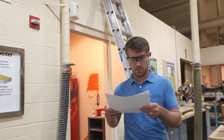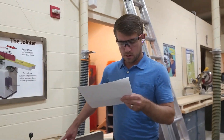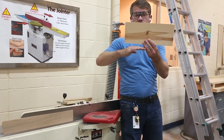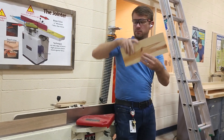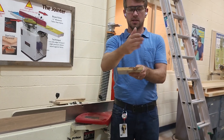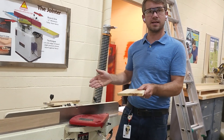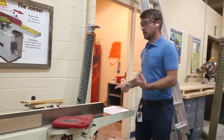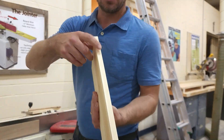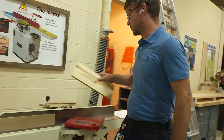The minimum length of material that can run through is 12 inches — it says so right on the machine. The jointer does NOT make edges parallel — parallel means both edges are the same and will never intersect. If the edges are off, you can't use the jointer to fix that. Run one edge through here to get it flat, then take it to the table saw, put that flat edge against the fence, and cut a parallel line. This tool can only clean one edge at a time.